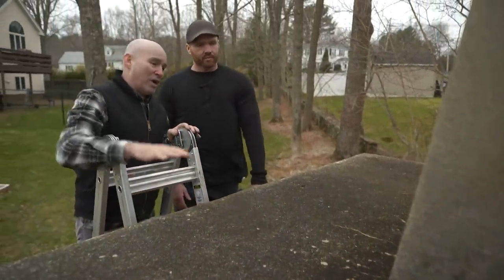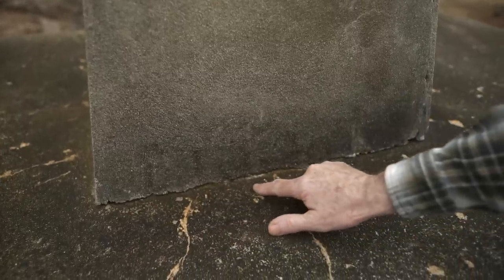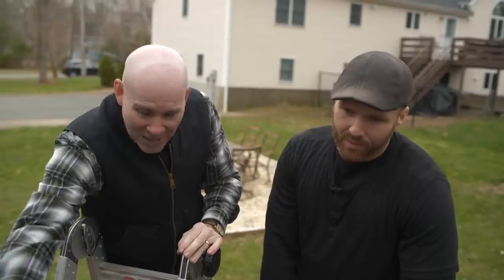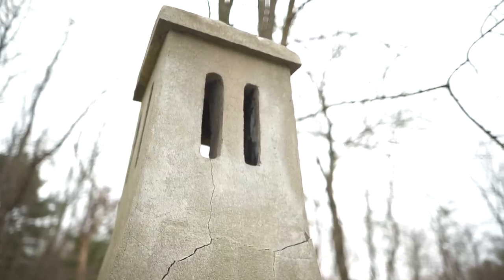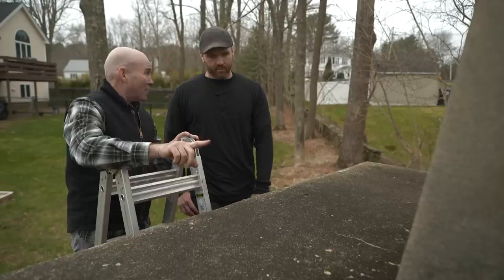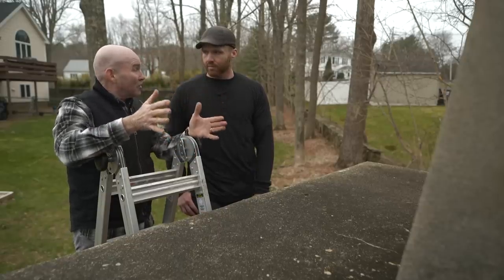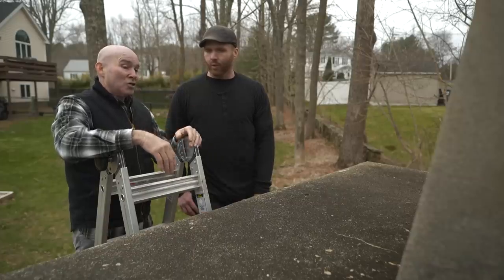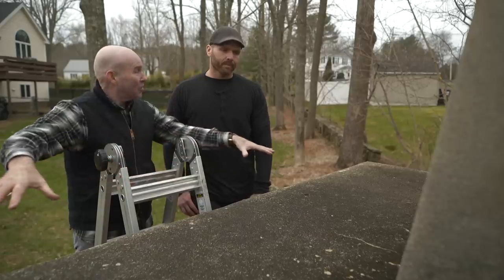Here we are at the top of our oven and, as suspected, you see that crack all the way along the front? That same crack goes down this side, it goes down that side, and it's also evident out back. That's our culprit. Unfortunately, this lighthouse figure — this cap that you have on here — probably has to come down. As I looked up from the bottom, I can see that the flue underneath this brick and stucco is just sitting there. It's not mortared down, it's not glued down. So once the water gets in there and travels through that crack, that's when it gets out and disperses itself.